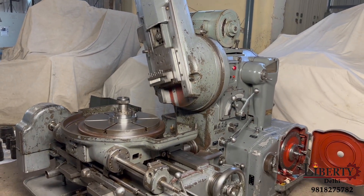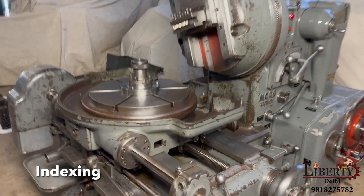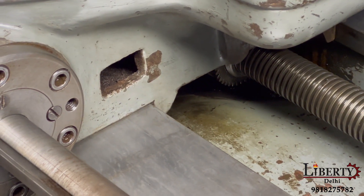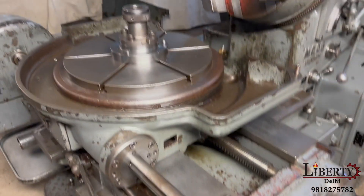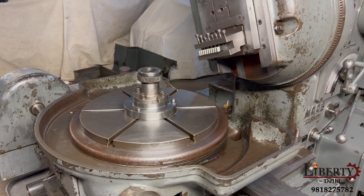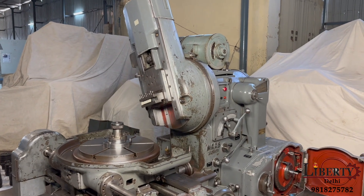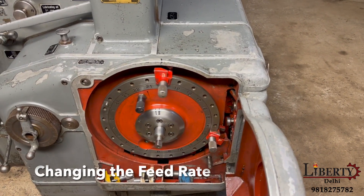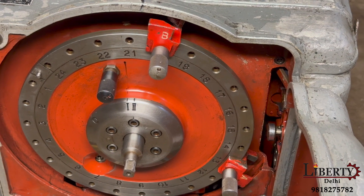The cutter goes up and stops. The table is back in the initial position — the rapid backward travel of the table can be seen and the table indexes. The next teeth cutting has started; the feed rate is medium. The rotation of the control disc per stroke can be seen.